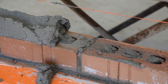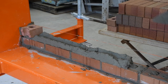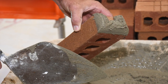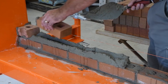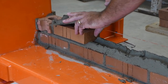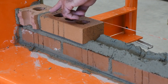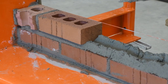We've got a full head joint — 100%. Spreading techniques help a lot with that head joint as well, but we want to apply that head joint as full as we possibly can. Now I've got my head joint buttered on the brick, as you can see, and that's a full butter on a head joint. Watch me apply this brick and let's see how the head joint reacts. I lay this brick up to the line, shave my excess mortar nice and neat, keep my mortar on my trowel so I can reuse it. Now look at this head joint — it's perfectly full, front to back. That's a nice, good full head joint.